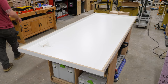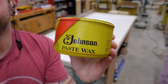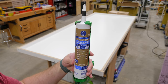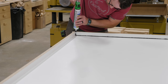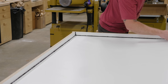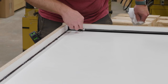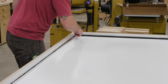Next, pulling a page out of my buddy Mike from Modustrial Maker's book, I wiped down the inside corners where I'd be applying the silicone caulk with paste wax, to make it easier to remove the excess caulk later. Finally, I added a bead of black silicone caulk — since it's easier to see — to all of the seams inside the form, which not only seals them but with some shaping will add an edge profile to the top edges of the finished tabletop. To shape those edge profiles, I used a fondant ball tool, another trick I picked up from Mike, and this gives the caulk a rounded profile while pressing any excess to each side of the bead.